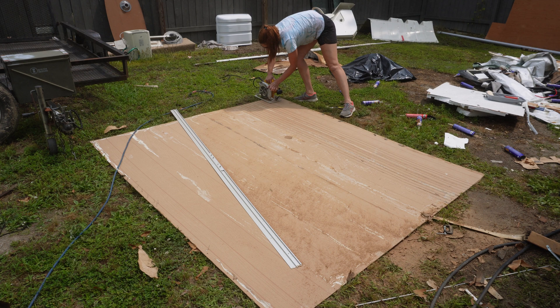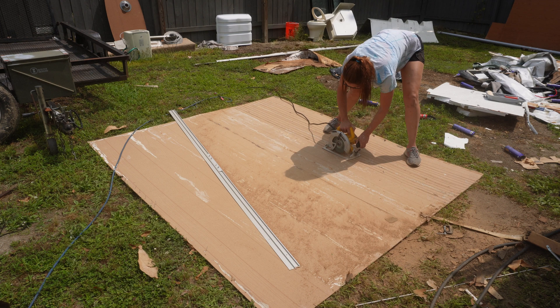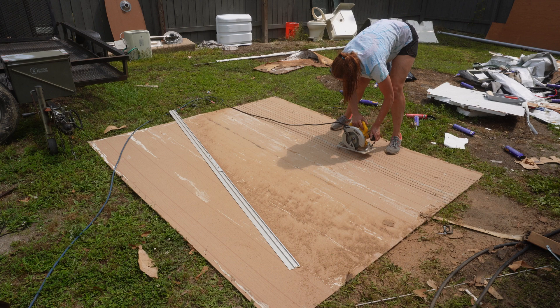This panel is only about an eighth of an inch, and you absolutely do not want to go all the way through and cut the entire piece. So I set my saw at just a little bit less than an eighth of an inch. I made my first cut with my saw guide, then pretty much free-handed it every inch and a half — because I could basically just line up the side of my saw with the line I'd already made. I test-bent it just to crack the epoxy and make sure it flowed freely. I made the front ones a little deeper because a couple cuts weren't as deep as the others. A hundred times better.